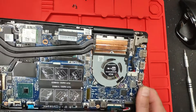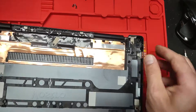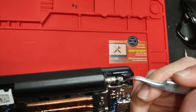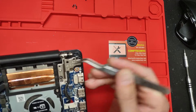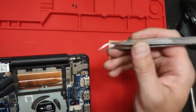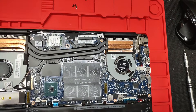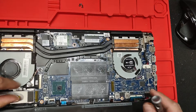So the screw is removed. The reason why it was not coming off easily is because this screw screws in behind the hinge, and that part of the thread is broken, so it was just spinning around on empty. That's the reason why it was not coming up. Now let's get back to the video.